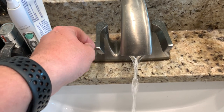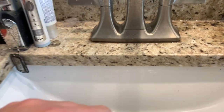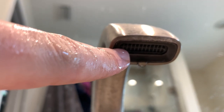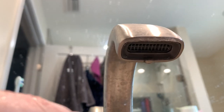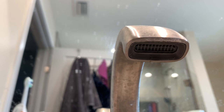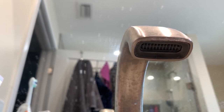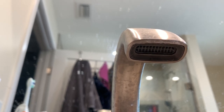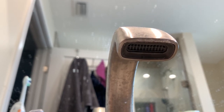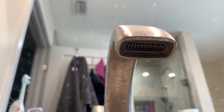I'm going to take you over to the one that has been fixed, but first I'll show you some things recommended by Kohler. They suggested removing this splash screen — there's another name for it. You take needle nose pliers, reach up in there between the fins, grab it and yank down. You usually break a couple of fins because it's not designed for any needle nose pliers anybody has. Once you get it out, there are a couple of mesh screens designed to filter out debris. The house is less than two years old. I have very hard water here in Bradenton, Florida. It was not full of crap — there was a little bit but it wasn't bad. I took it out, cleaned them, took all the pieces out — and even with them all out, I still had terrible water flow.